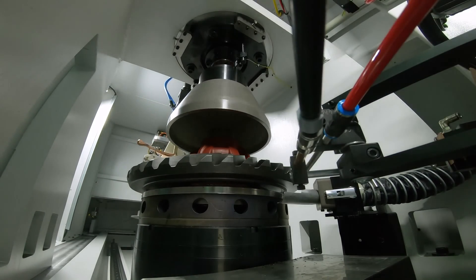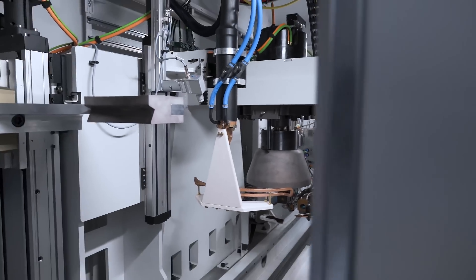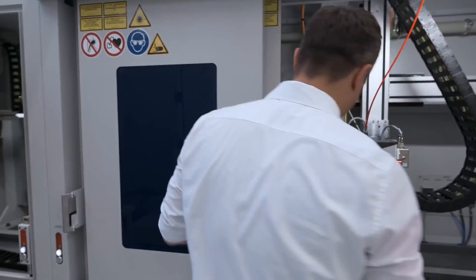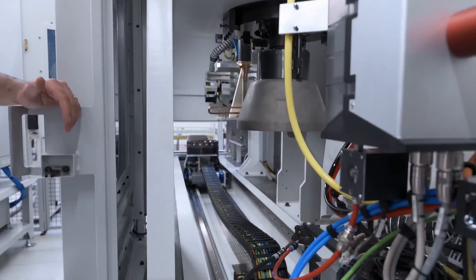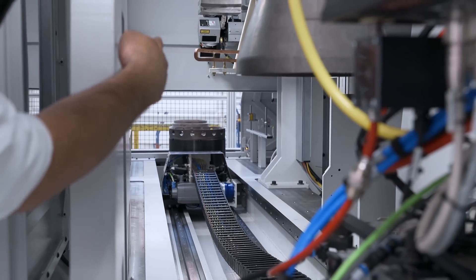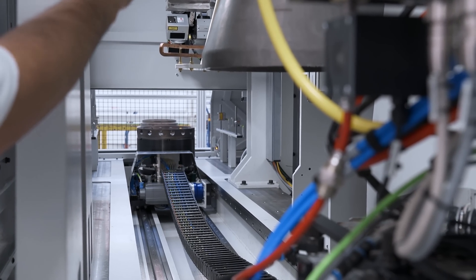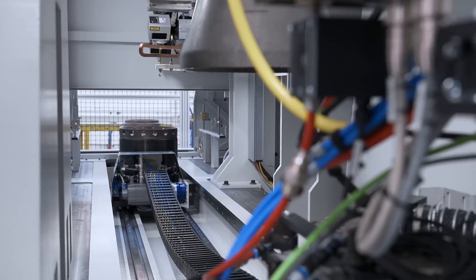Here we also join the workpieces together if needed, and as an option we have also implemented induction coil preheating before welding if needed. Then we start the welding function. The optic is fully equivalent to the first machine. The chuck is NC controlled, moving step by step from scanning, to turn-over, to pressing, to preheating, and then to welding.